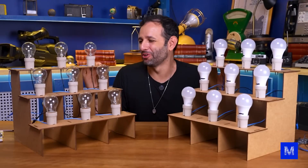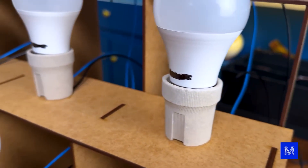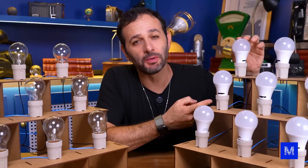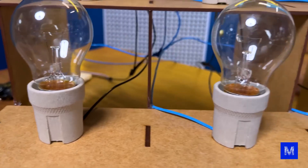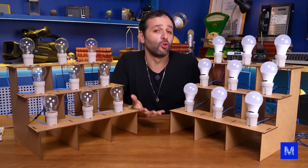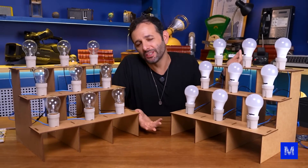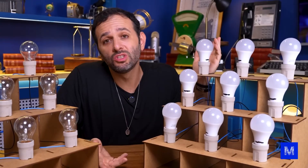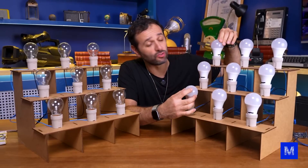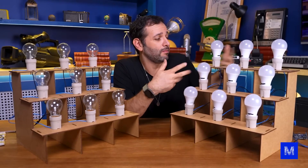Look how beautiful this turned out. All the bulbs are brand new — they've never been turned on. These are 12-watt LED bulbs and on the other side 25-watt incandescent bulbs. In the test the first row will stay on as our control. We must determine if a bulb will burn out during testing under normal conditions without switching on and off — after five days if a bulb burns out, maybe it was going to burn out anyway. We're putting three bulbs under the same conditions because if one has a defect, the others keep working since it could be a manufacturing problem.